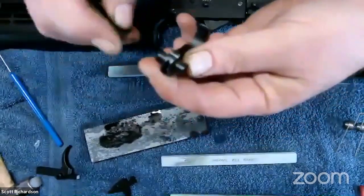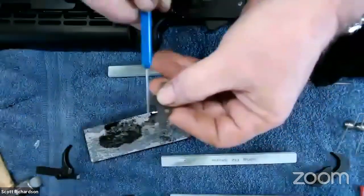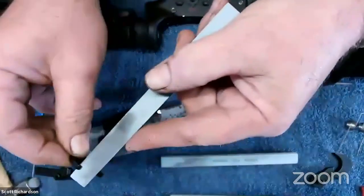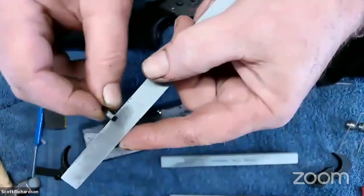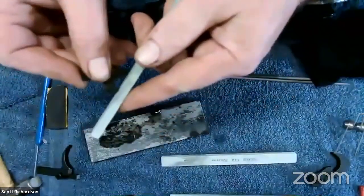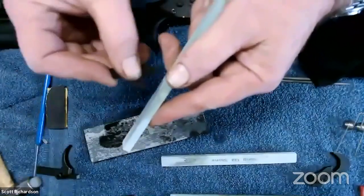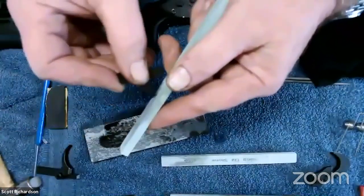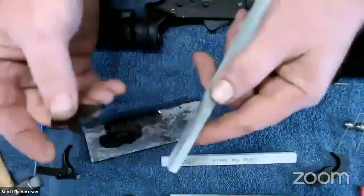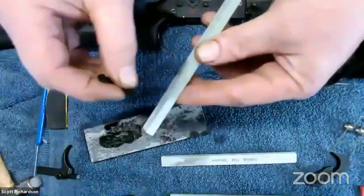You'll feel it get smoother as you go — less and less resistance on the paper. That's how you do the hammer notch. On this surface here you can also see a nice crisp angle that makes the oil stones a good candidate. This will take a good hour to do these surfaces properly. It's nice to have an audiobook or music on — just sit here and work on it, paying attention to those edges.